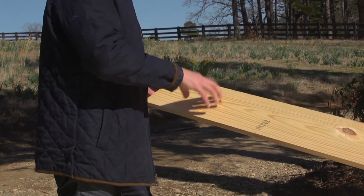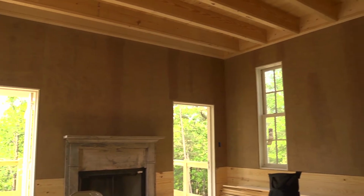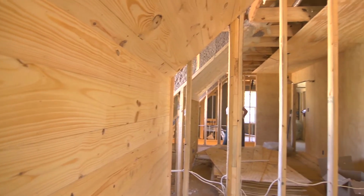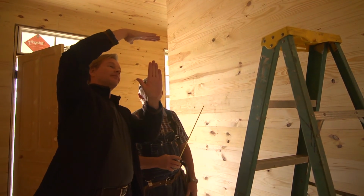In trying to work out the aesthetic of this farmhouse, we're going with really simple moldings, just basic boards, but we're going to follow the tradition of a certain hierarchy. The main rooms will have a bolder, wider trim board, a wider baseboard, a wainscot at about chair rail height, and a wider door surround and cap, as opposed to the upstairs, which will be much smaller, with no trim boards at all. We're following a hierarchy that was established a long time ago. The rooms where you'll have guests get a little more treatment, as opposed to the living quarters upstairs, which are a bit more Spartan.